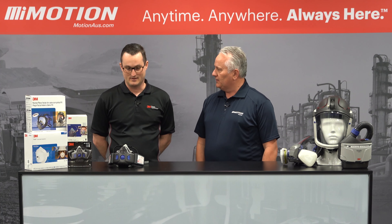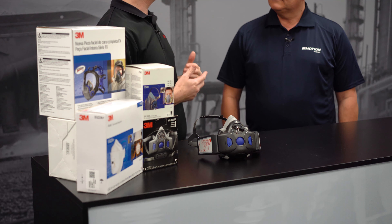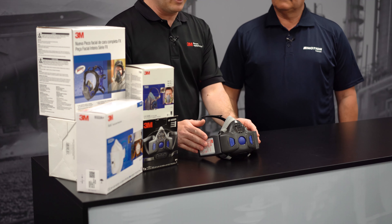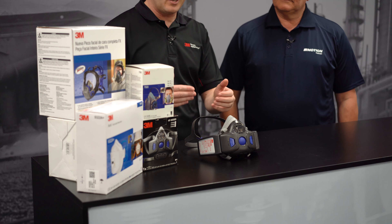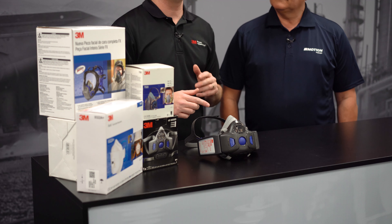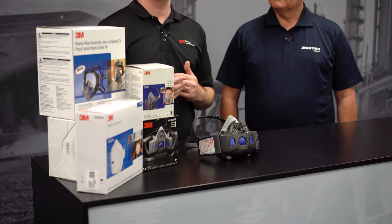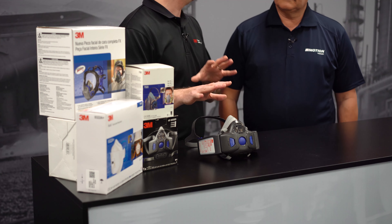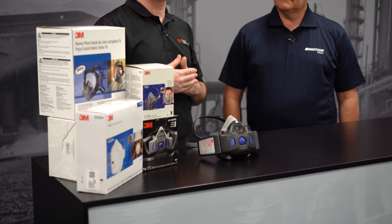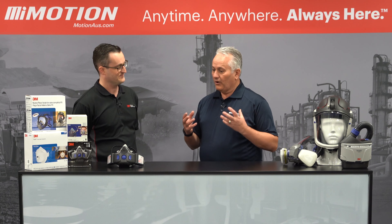Can we talk a little bit more about this particular unit? Certainly. So, this is a reusable respirator — it's a half-face respirator. A key thing a workplace needs to start off with is understanding what their hazards are. There are different types of filters for different types of hazards found in the workplace. I've got some P3-rated filters here at the moment, but you can also attach gas and vapour filters. One of the things I love about this product is actually the speech diaphragm on the front — it's a challenge for a lot of workplaces where you need to be protected but also communicate with co-workers or hear warning signals. It also has quad-flow technology, which allows more air to be drawn in through the filters to provide less breathing resistance to the wearer, offering more comfort over the longer term.